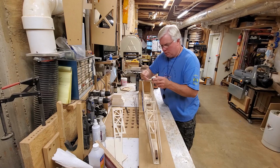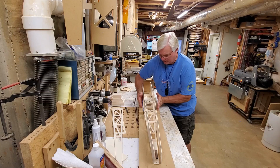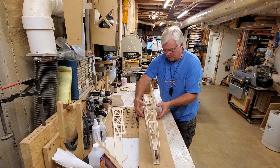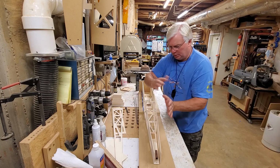And then you don't have to sharpen the next ones. Just push that in there and it stacks up rather nicely and holds everything in place past that bend. So these wedges are actually holding it nice and tight back to about right here. And from here back, I can get my fingers in there and hold that nicely. And as long as we're registered up, as long as our bottom is flat and we are registered up against this, we'll be 90 degrees. So we don't have to worry about building any twist into our fuselage there.